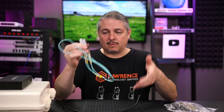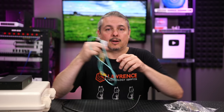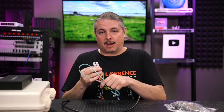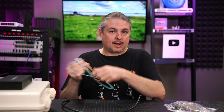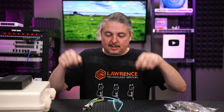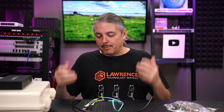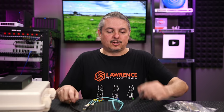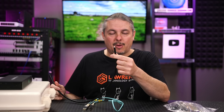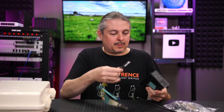What about doing something with fiber? You can get fiber — even if you don't have the tools to terminate it, you can have it cut at custom lengths with the ends put on. You can get jacketed fiber, which is essentially armored, so you can actually bury it as well. But fiber is still a little more delicate than cable, even with the jacket on — it makes me worry a little more. And if we go jacketed fiber, I can't run it directly into the Wi-Fi device because it doesn't carry power over it, and you need something to terminate into — so we'd need a switch.